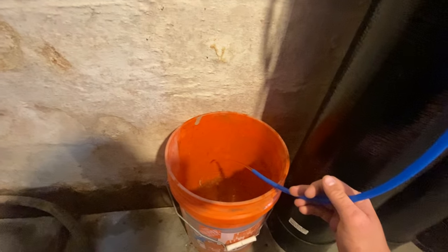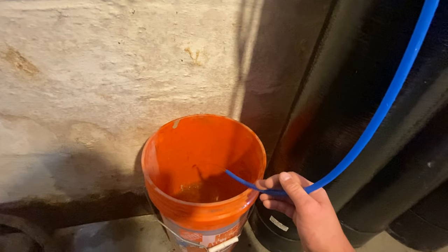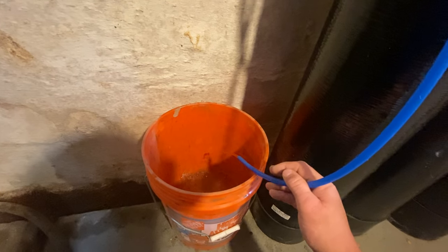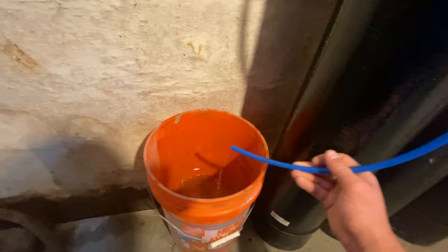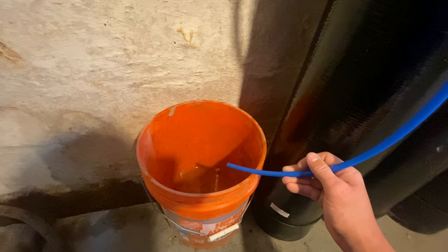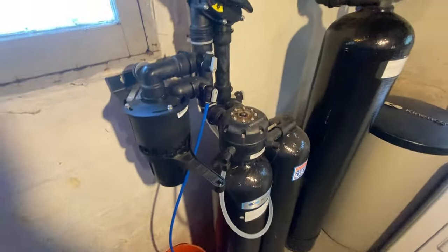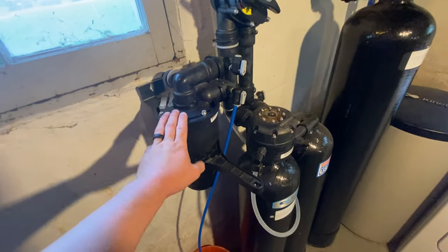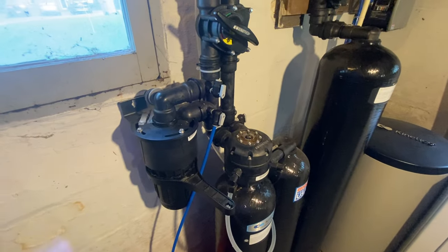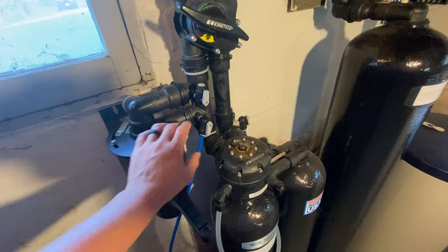This should take probably 20 to 30 seconds — it really depends on just how clogged your filter is. A general rule of thumb for maintenance on these filters is roughly every four to six months. If you're on a well, you're probably going to be more towards four months. If you're on a city water supply, you're going to be more towards six months. On some wells this filter gets gunked up completely to the point where it actually limits the water pressure inside the home.